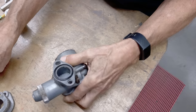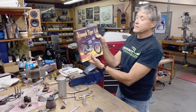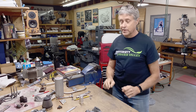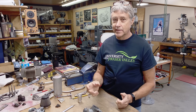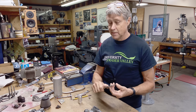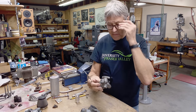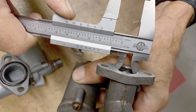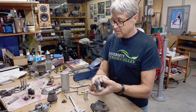I was reading the Tiger Cub Bible last night and I found a page with all the sizes of the carburetors. It said that in the early days the size was often 17 millimeters or 18 millimeters — I know it's an English bike but that's how it's recorded. Sometimes it was 11 sixteenths. So if I measure this carburetor here, it's a 19. A lot of the earlier bikes had really small carburetors.